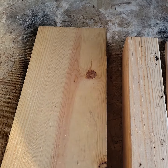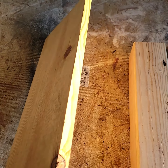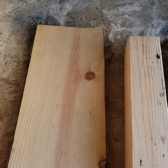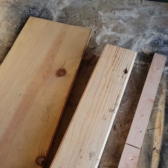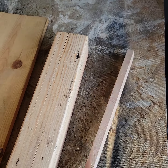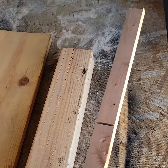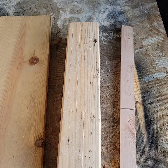You're going to need some materials. I like these nine-and-a-half by one inch by eight-foot-long boards for the catwalk — they're made out of pine, easy to sand. Then some four by fours, just stud-grade Douglas fir in the eight-foot size. I also love furring — this is a two-by-one, I pick up as much as I can. Today I picked up three or four of these, eight foot long. Also grab some wood glue, some screws, and a couple of small shelf brackets.